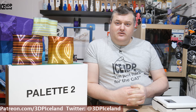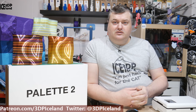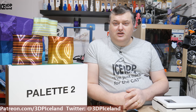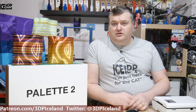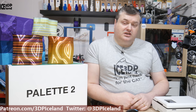I'm not going to review beta software as it's a work in progress, and they have stated they are working on getting it out of beta. For me I've been using Slic3r Prusa Edition with some settings adjusted for the palette, simulating four extruders since the palette has four inputs. Mosaic Manufacturing has pretty good information on how to set that up on their website and also on their PalettePlus Facebook page, where there's a community that can help you out with settings. I will probably do a separate video on my settings in Slic3r Prusa Edition for the palette.